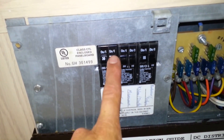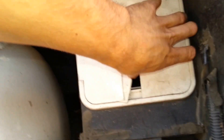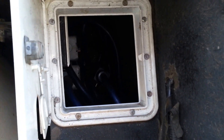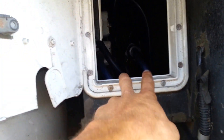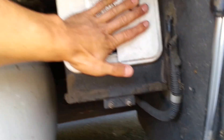So one of the procedures for firing up the inverter is to flip the converter off. Another thing that needs to be known is that out here, where the plug ties into the grid or the generator, needs to be completely unplugged. So I have to check that I'm not plugged into the grid. There's an outlet back in here which supplies power from the generator up front. Kind of an idiot-proof way to keep you from plugging your generator into the grid — you only have this one plug. I didn't design that luxury, so I just have to not be an idiot, so I don't fry my inverter — or possibly my generator, if I fed power from the inverter into the generator, that could very well screw some stuff up.